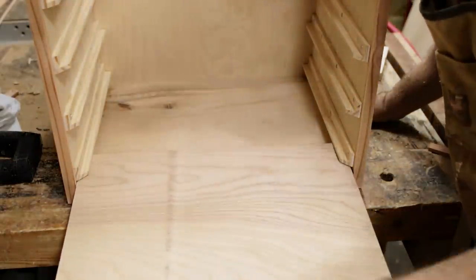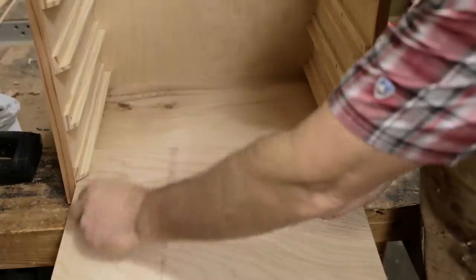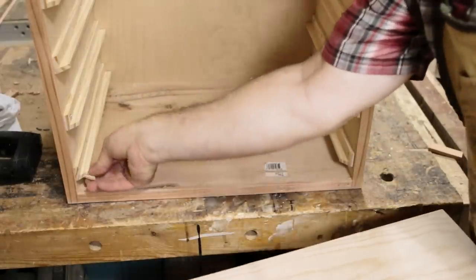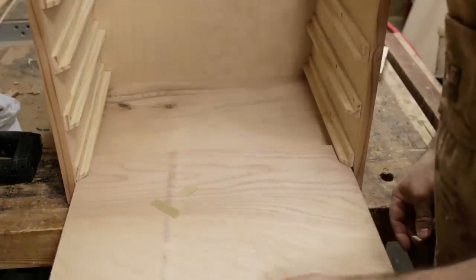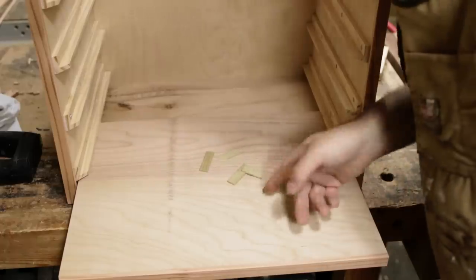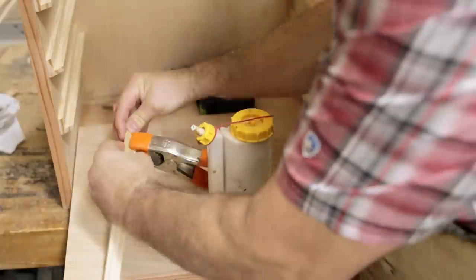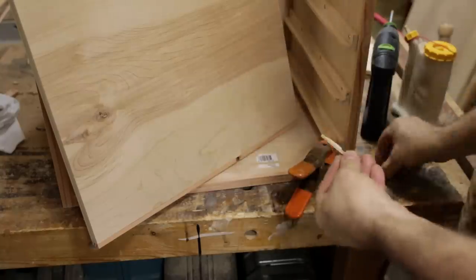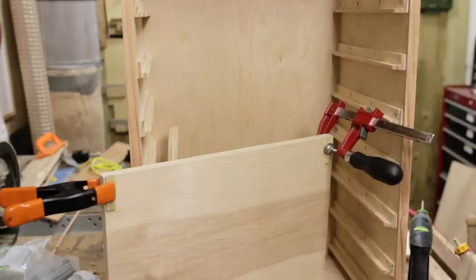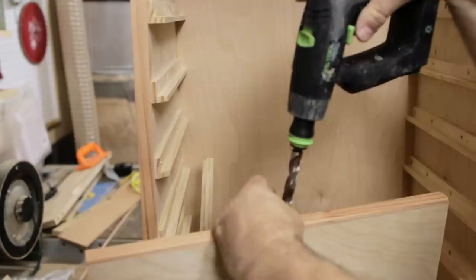You can see it's a little bit wobbly and it could also pull out too far. So I've cut a few little pieces here that will get attached to the back of the drawer and the underside of this runner — that will A, keep this from rocking, and B, keep it from pulling out too far. So let's get those glued in place. And just a little bit of dowel that'll give me a nice handle to pull this out with.